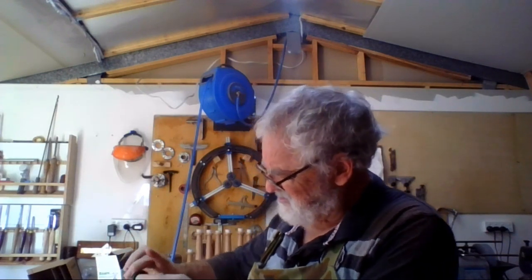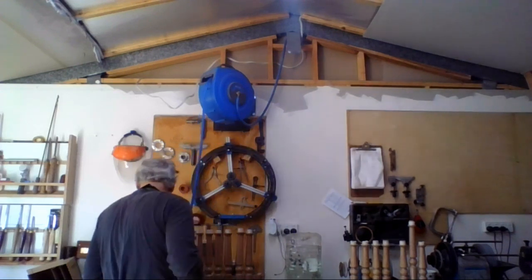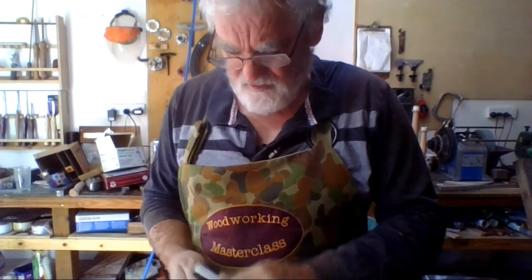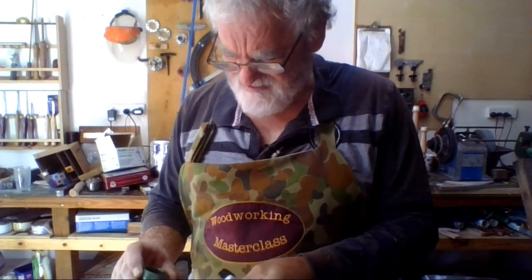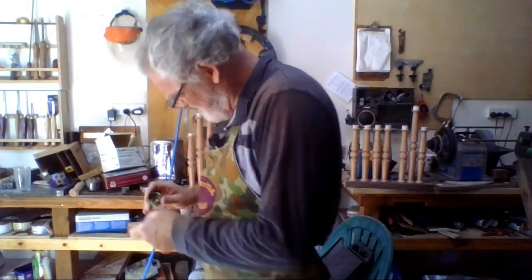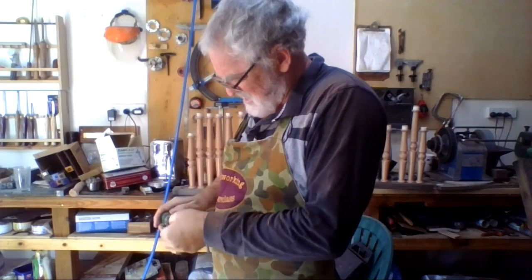Good and bad with water-based stuff. Good thing is it's easy to do a clean-up. Bad thing is with nitro-based or thinners-based stuff, I'm just cleaning this tip out. You can just run thinner through it and it solves your problem, whereas water base is a little bit dicier. Bit more involved. That's pretty much it. I'll just go over the tap.